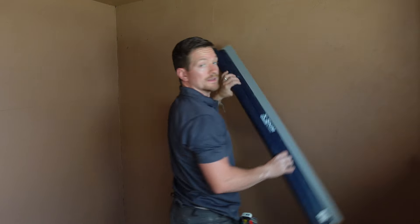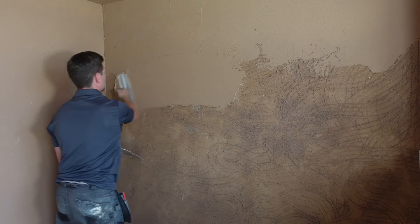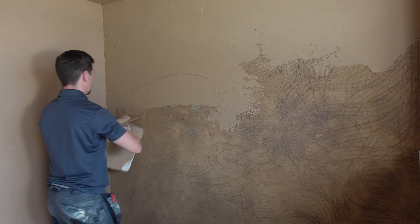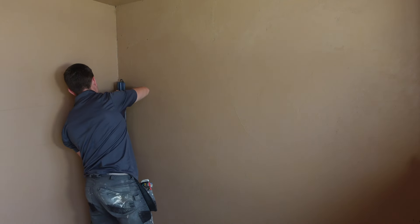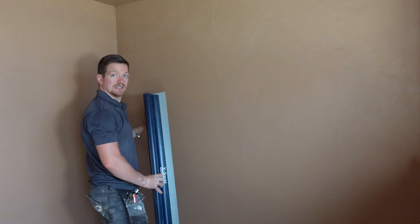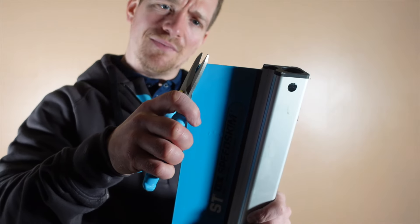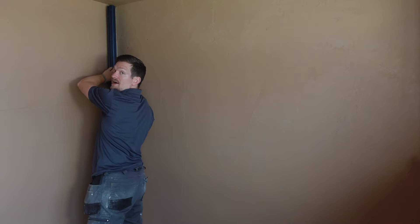This wall was a bonded wall and it's actually pulling in very fast, but even with that it's still flattening the plaster, so it's tough. It can really hold its own weight and it feels like the blade's a bit sturdier in your hands — it's not as flimsy. I think I need to adjust the edges of the blades a little bit because it's leaving a few lines behind, but to be fair I had to do the same thing with a Speed Skim, so that's expected. I'm pretty impressed, I'm not going to lie.